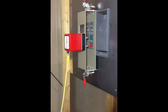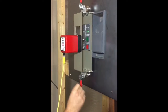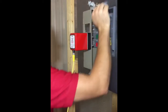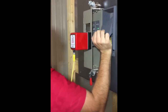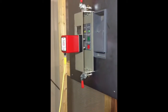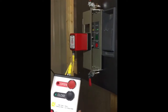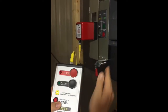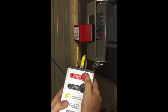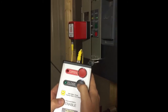This SPB100 is currently in the open position. We're going to close it. In order to close it, we first need to charge the spring. Now the spring is charged and I'll grab the Chicken Switch remote control. We're standing up close so you can see the buttons as they get actuated. I'm going to enable it, hold the Enable button, and close this breaker.